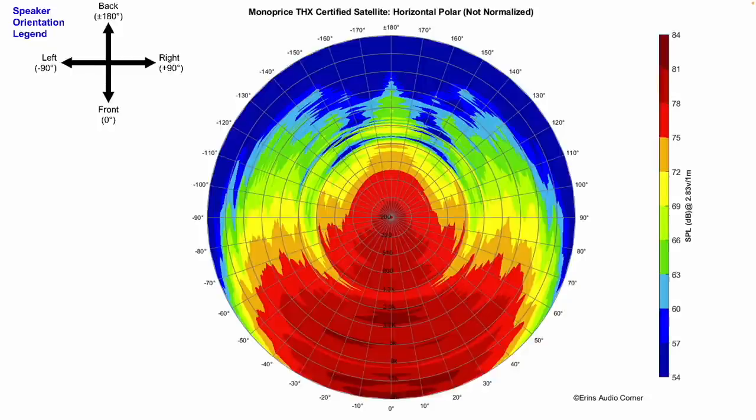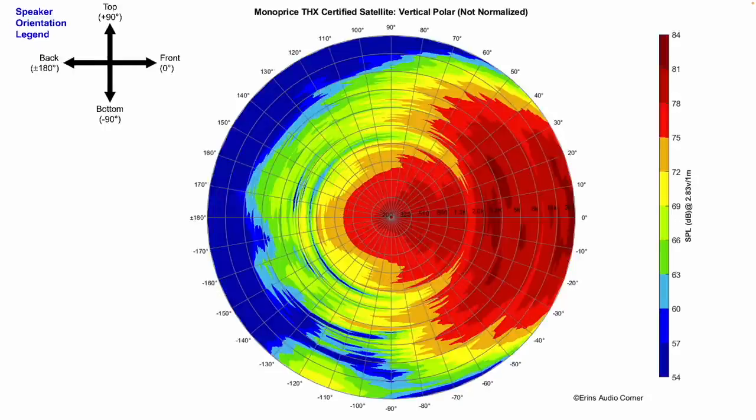This is the horizontal dispersion at about plus or minus 60 to 70 degrees, depending on the frequency — everything looks good here. This is the vertical dispersion, which is pretty much the same as the horizontal dispersion, also about plus or minus 60 to 70 degrees. In other words, you can aim the speaker pretty much however you want to — you can sit above or below it however you need to in your room — and you're going to hear roughly the same sound profile. Within about plus or minus 30 degrees vertically and off to the side, the speaker is going to do very well.